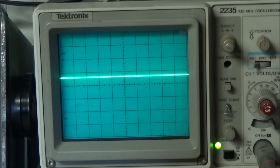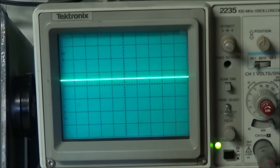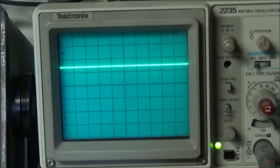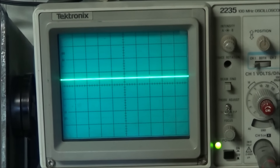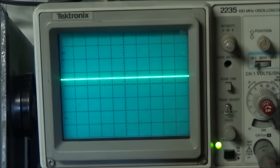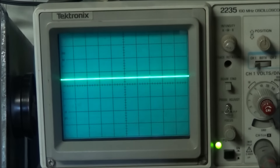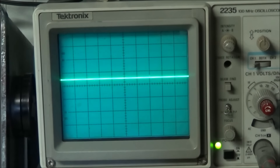Now we're at 18 megahertz and it's in lock. 24 megahertz is in lock. Now you see it's fluctuating and it just went out of lock. Back to 1.9 megahertz. So it looks like we're getting a lot of intermittent readings as we go through the bands. This tells me that the voltage on the PLL is about right — there shouldn't be a problem with the voltage.